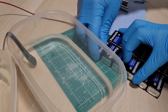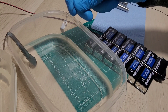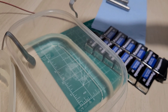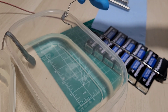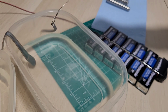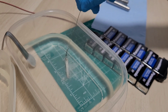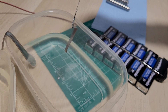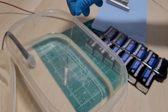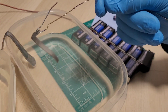Connect the negative to the battery pack, then attach the positive titanium wire to the pen clip. According to the voltage chart, I want a deep gold on the body and bright green on the clip — green is near the 100-volt range. We dip it in and you can see the bubbles forming. After a moment, we're not getting much color on the clip — it may not be titanium.